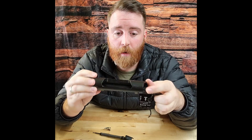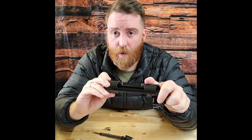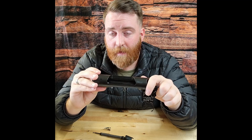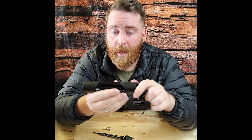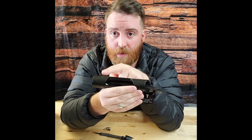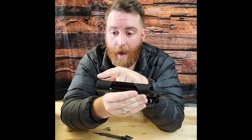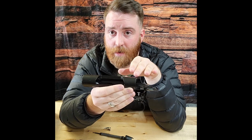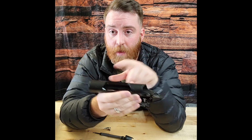One of the only other reviews on YouTube about this action that I found, the guy complained that this doesn't take Remington 700 scope mounts, and you would think with it being a Remington 700 clone that it should take a 700 scope mount, but I think that the 700 scope mounts are actually inferior. I think that design was inferior because it is a lot easier to get these two surfaces parallel when the entire body of the action is round. When you've got a surface here that's round and you've got a surface here that's flatter, it's got a radius to it still, but that's a lot harder in the machining world to get those two surfaces to be completely parallel.